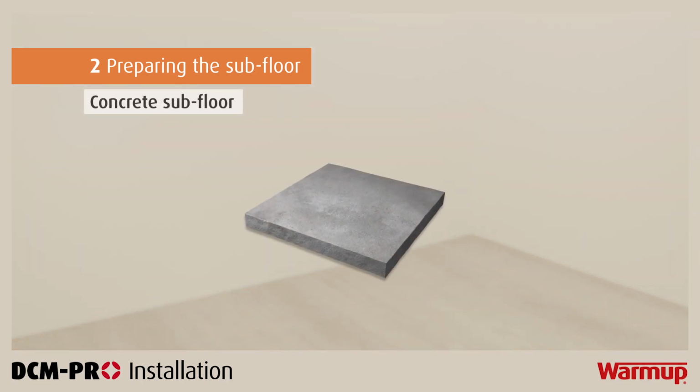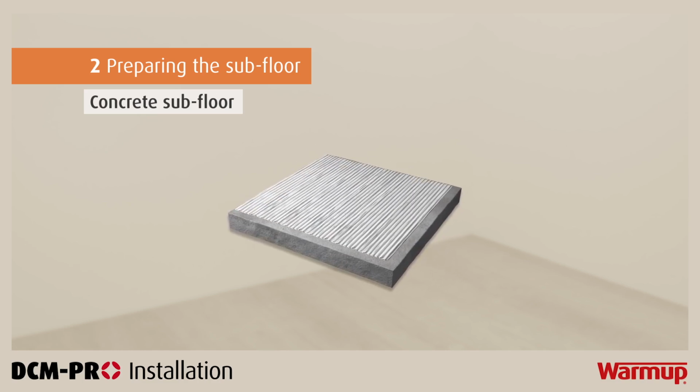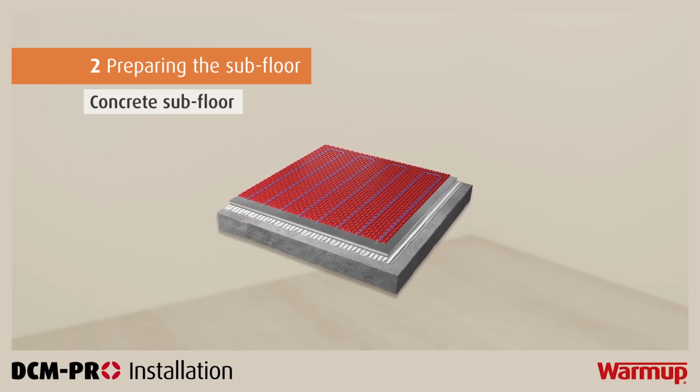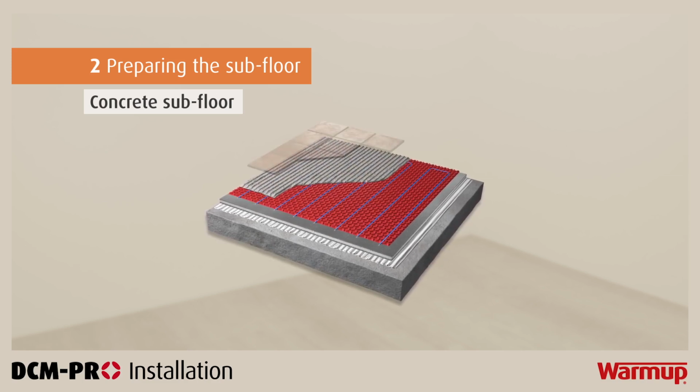Here you can see the different layers that would be laid on a concrete subfloor. Ideally, you would add flexible tile adhesive, warm-up insulation boards, the DCM-PRO mat, your DCM-PRO heating cable, tile adhesive or leveling compound, followed by your floor finish, whatever it may be.